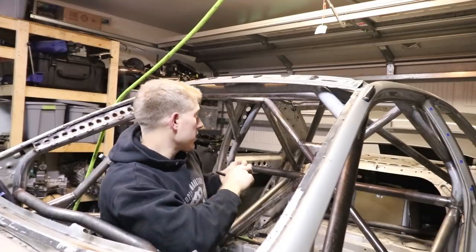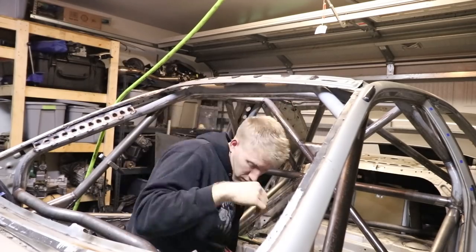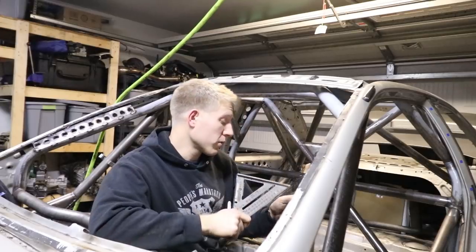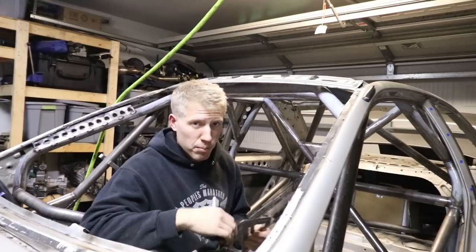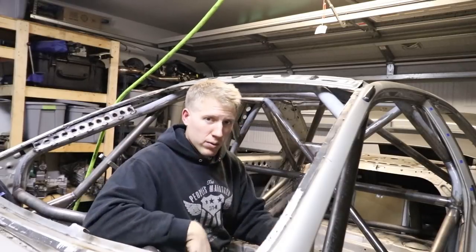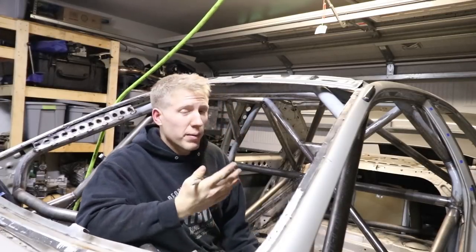So I'll start getting measurements here, then we'll cut it out and bend it, dimple die, and do all that kind of stuff. I have my measurements - I'm going to make it 12 and a half inches long by four and a half inches wide. The edges will be bent up at an angle and I'm going to notch them for the tube, and it should fit decent as long as my measurements weren't crazy.